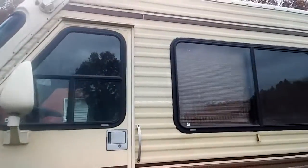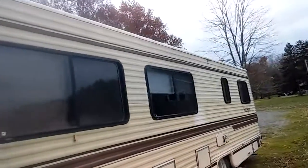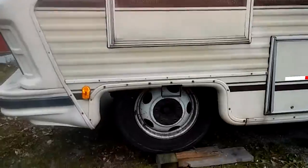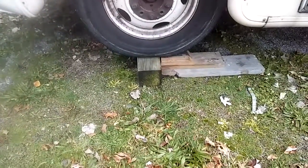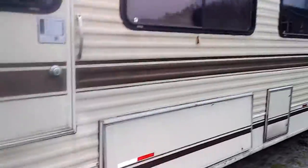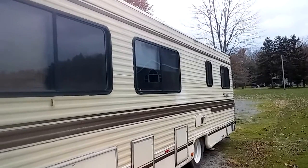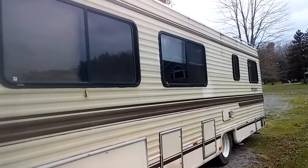When it rains, the water is just going to run right off the back of the roof. And you're not going to puddle. And it's not going to freeze and bust all the caulking and get leaks all over the place. But that is the simplest cotton picking thing that you can do right there. Run it up on some boards and put it up in the air about 6 inches in the front, and let the back dangle down, and you get a nice gentle slope, and the water will run off and save your roof and save you a lot of time and frustration.